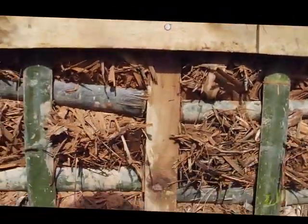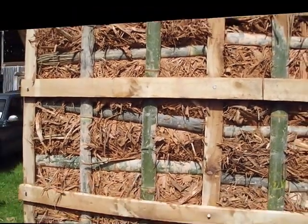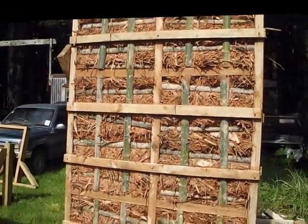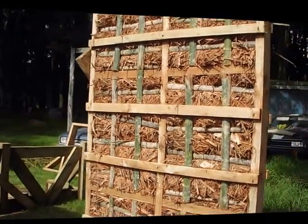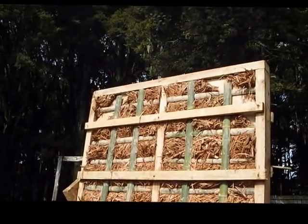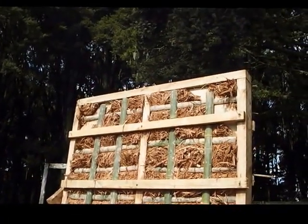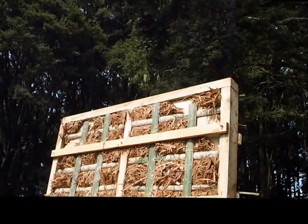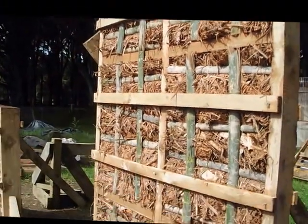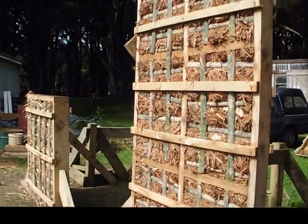This could be done right next to the foundation, so that it can just be like a tilt panel and just be infilled, and you know, the slats and the battens and all done on the ground. Much easier to work on the ground rather than climb up the top there and try and stuff light earth fibres up while standing on your scaffolding.